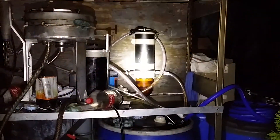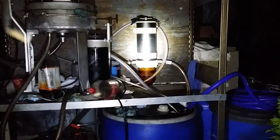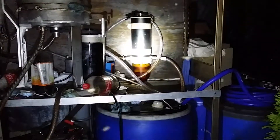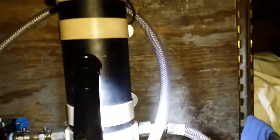Also you can see right here — that is a filter, actually I don't want to give the name because that might be wrong. Anyways, inside of it is a 2-micron filter before it goes into the tank. Right there I got a pump — a 12-volt pump, got a battery right there. That pump does do the job, but since this is a 2-micron, it's hard to push the oil through.